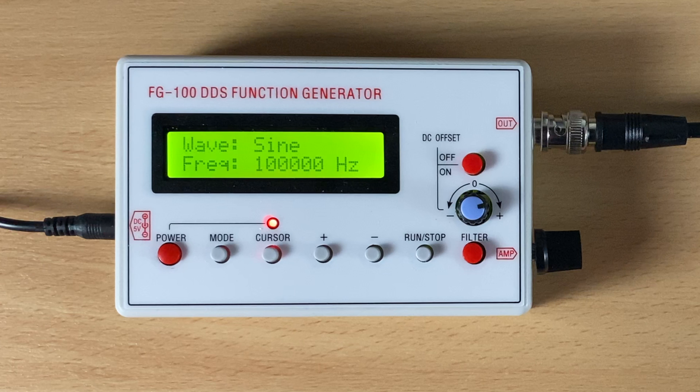How you get it into your amp, I'll leave that up to you. Technically, you should be running your amp into a dummy load, but if not, well, you're just having fun. I'm going to test a headphone amplifier I happen to have lying around, into a dummy load of similar impedance to my own headphones. So here I have a cheap but useful function generator, which I've put on my old scope before, so I know that it's clean enough. I'm going to feed it into the amp using a BNC to jack cable.